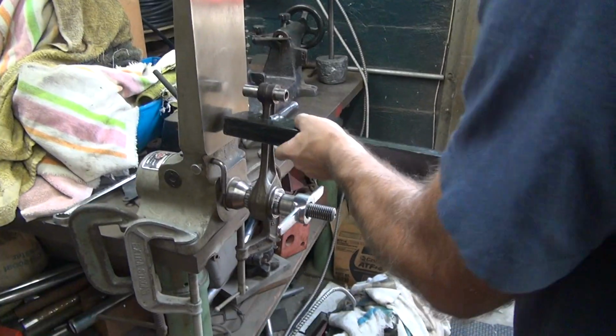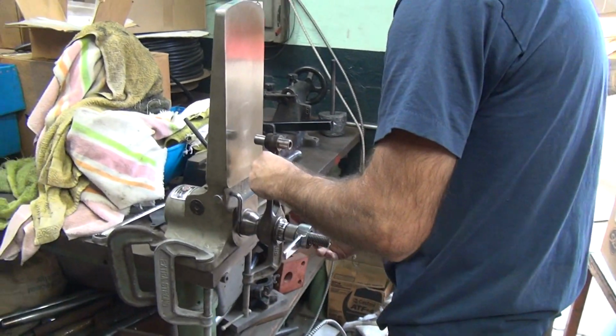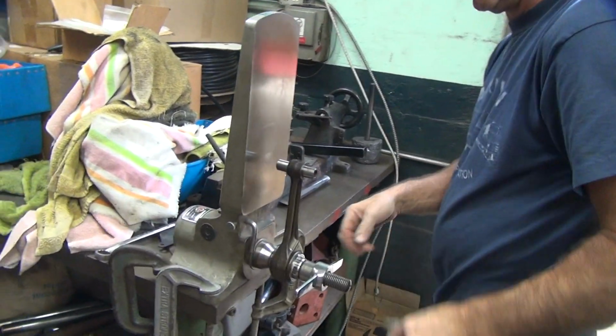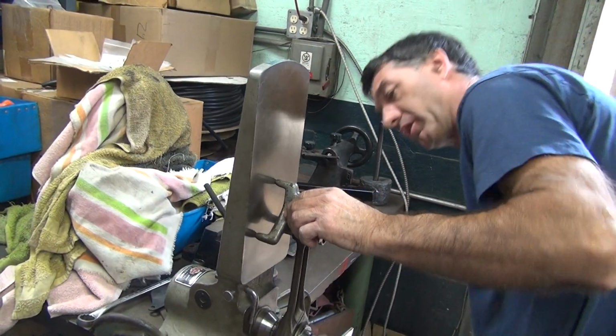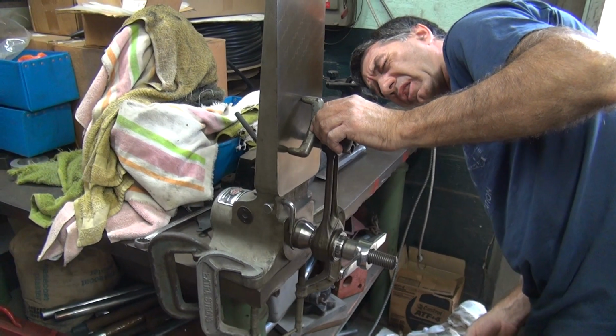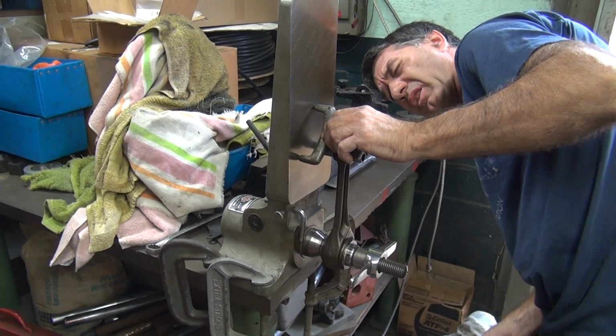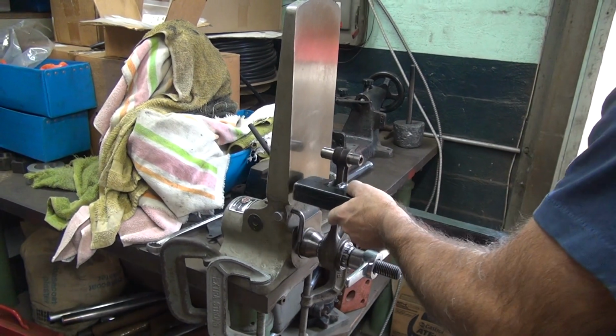And we're only talking probably about 20 thou. Not too much. And reset it. Get it realigned. It always moves over here, so you got to reset. Even though it's on a taper, when you're forcing it, it moves. You always realign stuff. The trick is to make it repeat. So we have repeat, repeat, set on the bridge. Yeah, if it doesn't repeat, it's not accurate.